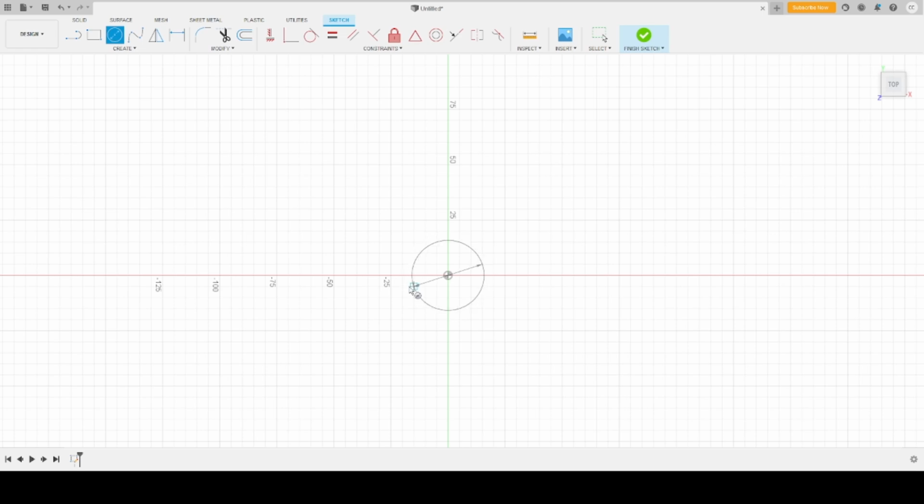Once I get all the parts drawn on this, I will have to put it in another software that writes all the G-code for the 3D printer. It adds in the filament, so you put what style filament you have. It has the size of nozzle tip you're using. It runs the temperatures for the head control, the bed, all the goodies. So stick around and I hope you enjoy.